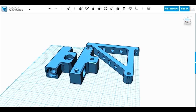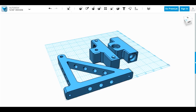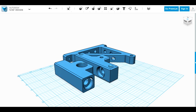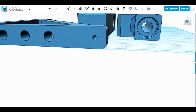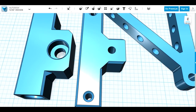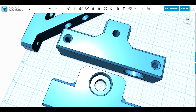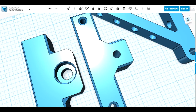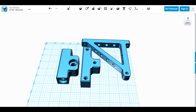We've got a right angle bracket which is going to support one end of a piece of studding at the other end of the piece of wood from the previous clip, and we've also got two blocks. This is for one shoulder — basically some bearing blocks. These are T-shaped, so we can put a rod all the way through and then make another axis rotate against it. The second T-shaped piece is that second axis. The two smaller holes at the end of the middle piece are to hold the shoulder bell on, and we've got a couple of places to put bearings. It'll be easier if I print these out and show you in real life — let's get those printing on my pair of Lulzbot printers.